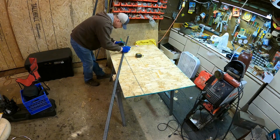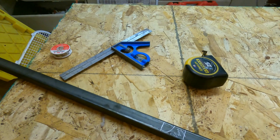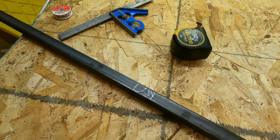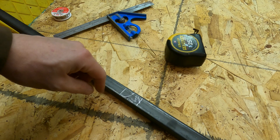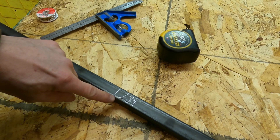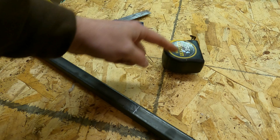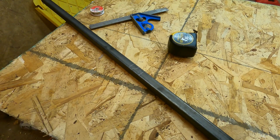Because I'm a glutton for punishment, I'm trying to do something fancy. I want the outside edge to have a rounded corner, just because I don't want to snag your expensive ice gear as you're wandering around with your cold beverage and cold fingers. There are ways to figure this out mathematically, but math in my brain doesn't work all that well. So I measured the distance from the point and around as best I could with the tape measure. I'll cut out what's scribbled out, and I'll be able to heat and bend that around to give it a contoured shape and weld it up from there.